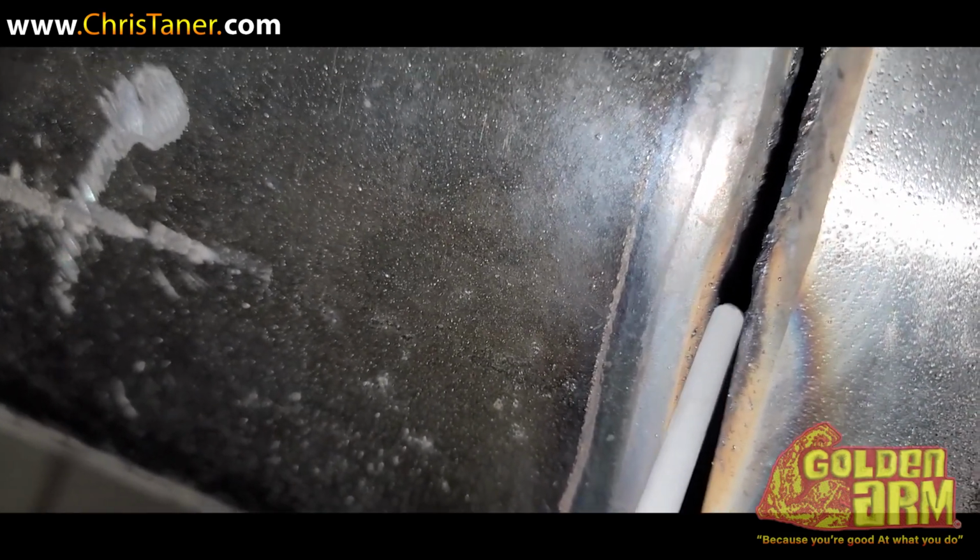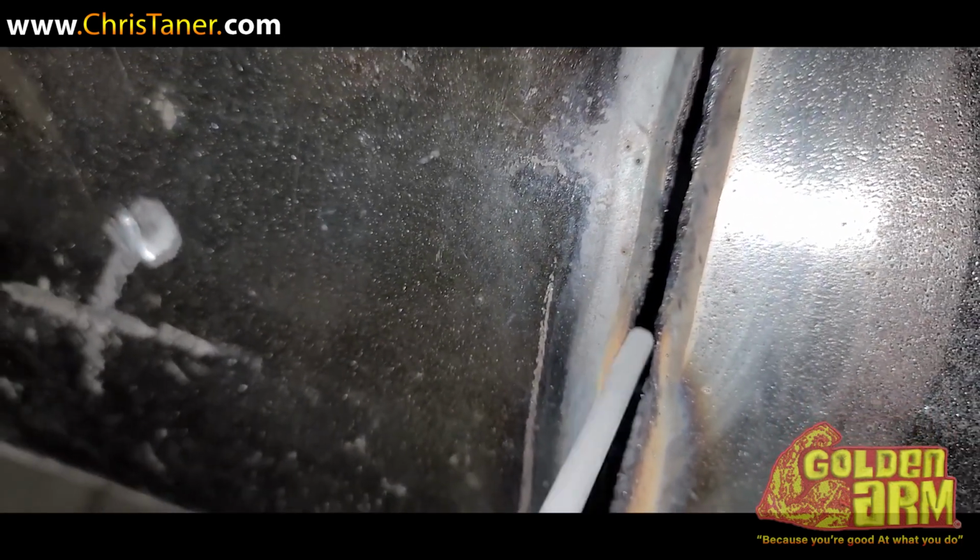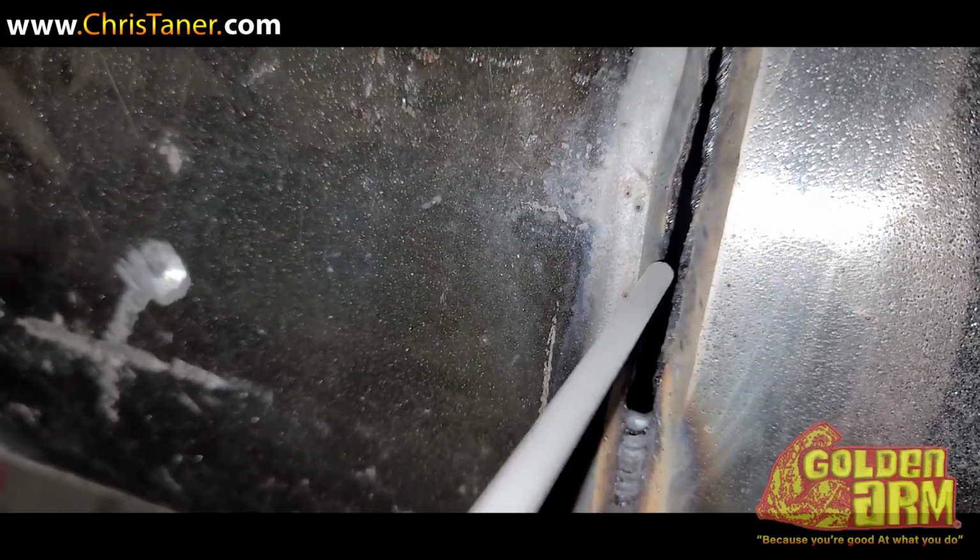And then with that, you can go back and start where you left off and run that root. You get what I'm telling you? So basically, all I did was close up this gap a little bit by allowing the 6010 to spray metal onto the edge of the bevel to give me a closer gap.